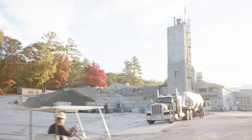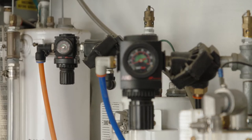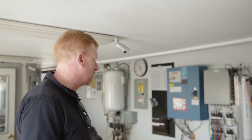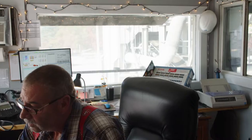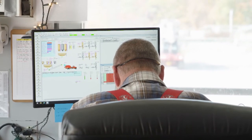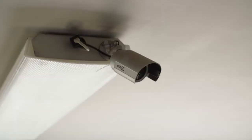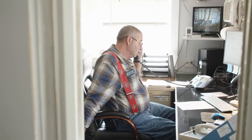This is the control station for all our admixtures — all the chemicals that go into the mix. It's all sensor-monitored and can deliver quantities down to ounces; only a little bit goes into each load, so it's pretty technical. The dispatcher runs it from the control room using batching software where he puts together the recipe — sand, stone, admixtures. He's also got a camera to monitor as it dispenses and keep an eye on it.